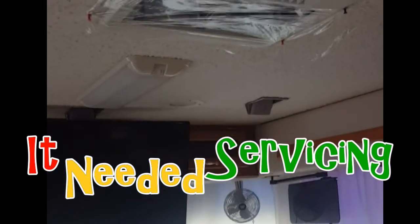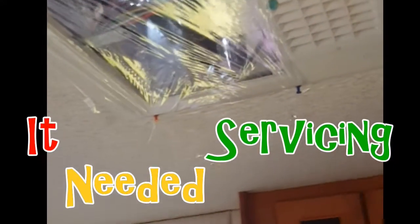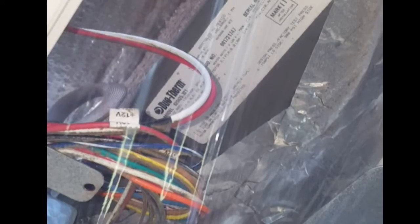Okay, air conditioning maintenance. Lori was getting some things happening — her eyes kind of being itchy, then her throat and such. So I looked at what was going on up here and we've got a little bit of mold in the system. We cleaned the filters and the condenser, but this front side heat exchanger is kind of dirty, so she's gone off to Home Depot to get some mold control stuff to spray up in there.